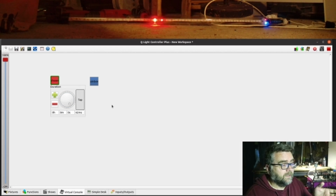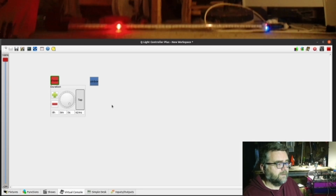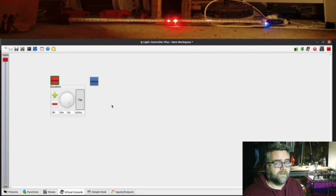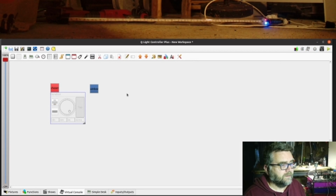There's also sound reactive. You've got to battle a bit with sound reactive on WLED. You've got the ESP32 only, and once the pixels get up there, it starts to struggle. If you've got a computer which is dedicated to it, it's going to be a piece of cake. It's QLC+ or Q Light Controller Plus in a nutshell. Definitely hook it up and give it a go with your WLED lights.